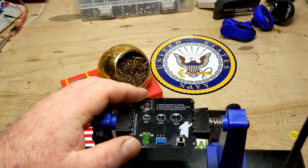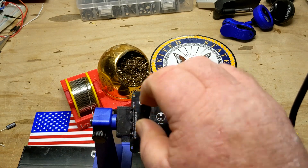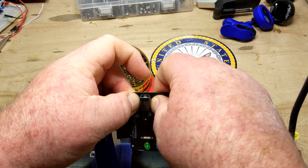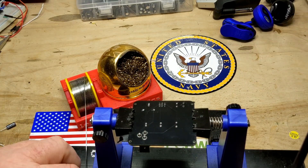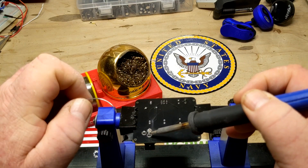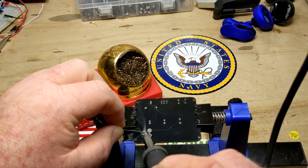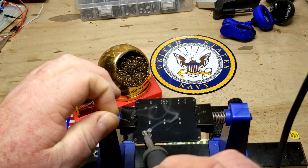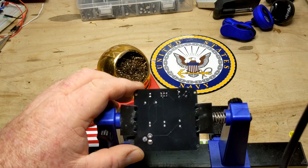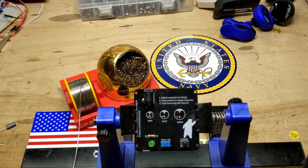You might notice there is only one resistor here and it's being used as a current limiting resistor. You're probably wondering why I didn't add other resistors into the RC time constant — well, not yet. First I just want the students to understand that the capacitor charges and discharges, and that the size of the capacitor is directly proportional to that. Once they understand that, then I think we can add in the resistor and start talking about RC time constants and controlling the charging rate of the capacitors. I don't want to throw that at the students too early in the game.